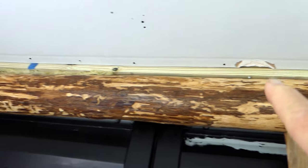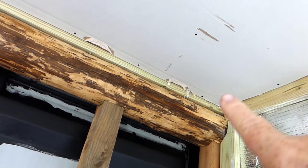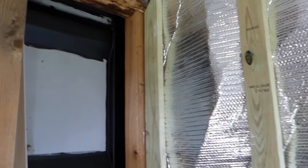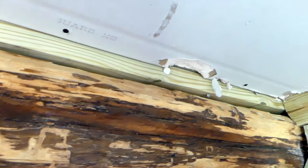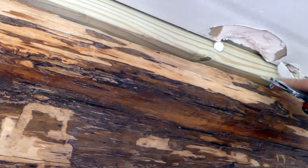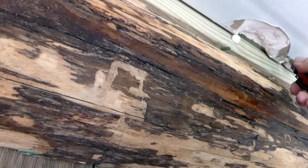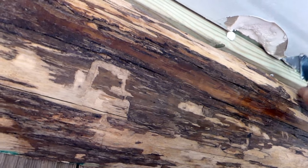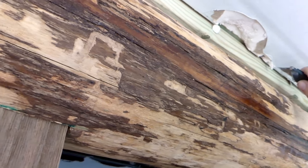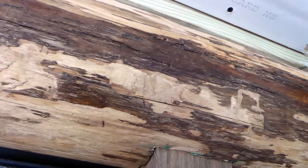So let's go ahead and work on this corner. I had some broken drywall — I bought it broken because it was the last of the 5/8 inch 12-foot sections that I needed. An 8-foot section would have been about 8 inches short and I would have had to put a seam in the ceilings or walls, and I don't want to do that. Since I'm accepting the flaws and building them in as part of the style, I didn't damage this entirely myself — it came like this. The vendor didn't want to sell it to me but it was the last of the 5/8 inch 12-foot in this area.